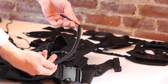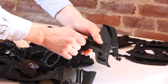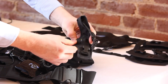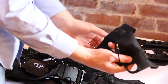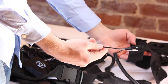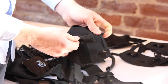On the other side of that sensor, connect another short coiled T2, which will go directly into the nearest side of the next sensor on the upper arm strap. From here, connect yet another short coiled T2 cable and connect it to the first sensor on the hand strap. To connect the two sensors on the hand strap, grab a short male to male T1 cable. The hand controller will go on the end of the final sensor.